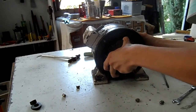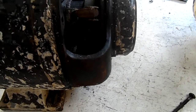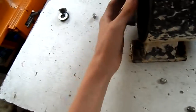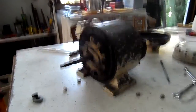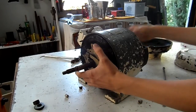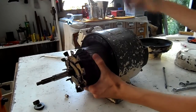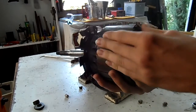All right, we're still locked in by something. I see there's a couple more end bolts on the side. There must be a couple of end bolts on the side - sorry the camera's giving a bit of grief. So I'll take those off and then that'll probably slide - I didn't realize the whole brush mechanism comes out with the rotor as well. There we go - there are two through bolts at the back that are actually holding this brush assembly on, so hopefully I can remove the rotor. And there it is - it's one very heavy piece of very nicely made machinery.